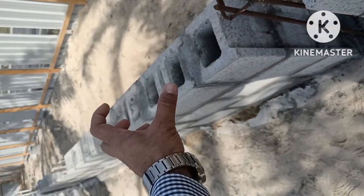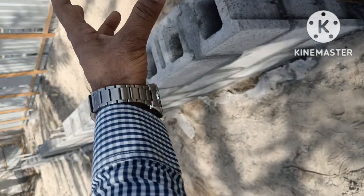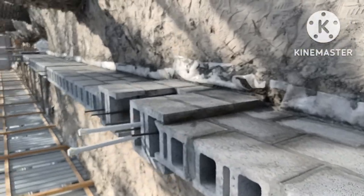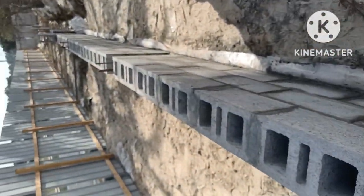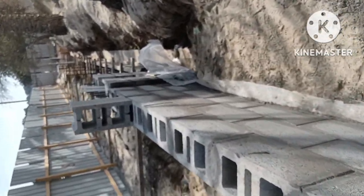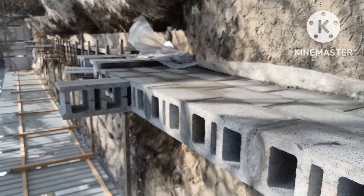The small columns where the chain link hinges, plates, and base plates will be connected with the RCC column — they will plaster it as well. Conduit for ELV and electrical points has been done, and two sample panels have been prepared. You can see the ground beam and the boundary wall starting from that side. They are doing the block work and the footing is going to be buried. Hopefully this video is very useful for all of you — if there are any comments, please ask, and please like, share, and subscribe. Thank you, bye bye, Allah Hafiz.